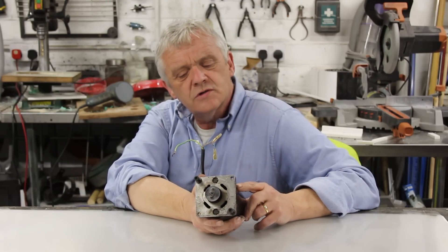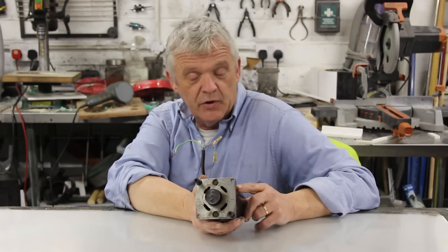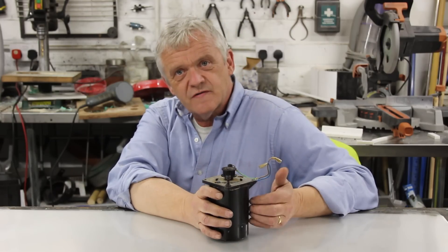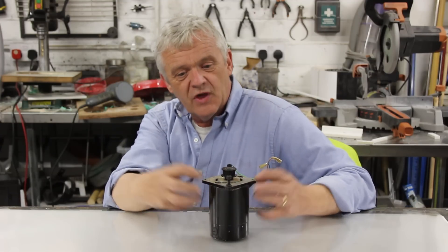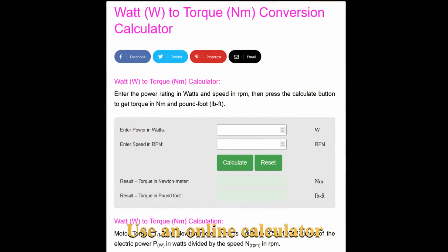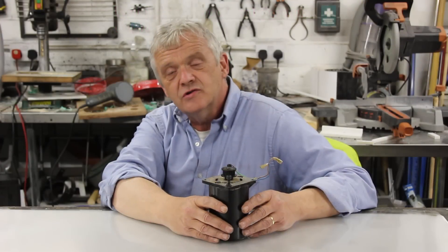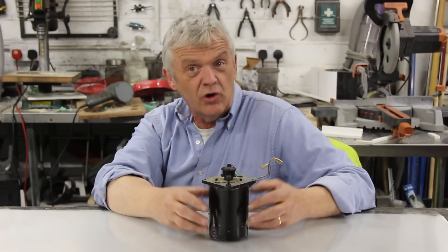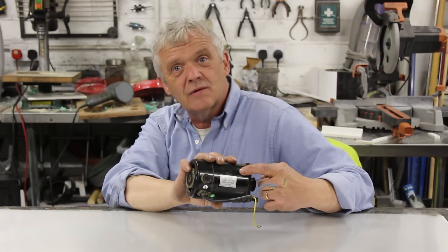This particular motor is a 150 watt motor at 230 volts DC, which means it takes about 0.6 of an amp. So if I put 230 volts at 0.6 of an amp in here, I get a 150 watt motor with turning force on there. The turning force is easy to calculate — it's just the power in watts multiplied by 9.55 divided by the RPM. This motor's RPM rating is 4000 RPM, and we know all of that just by looking at the plate.